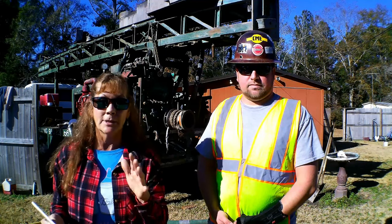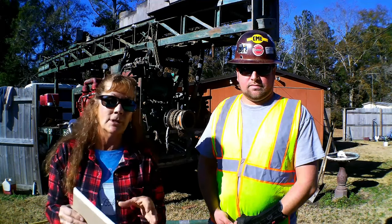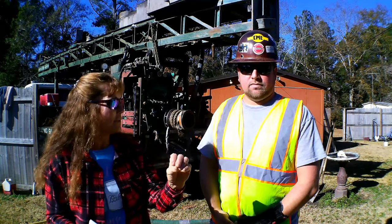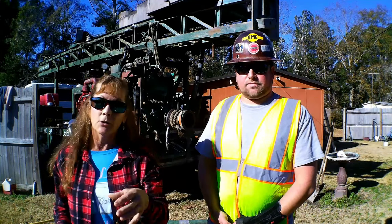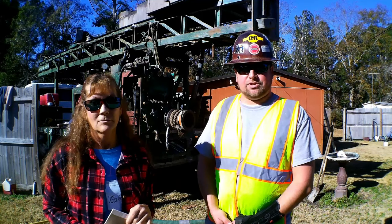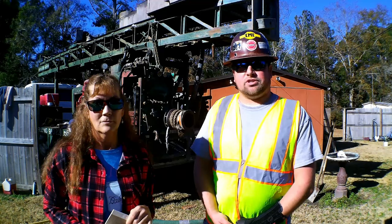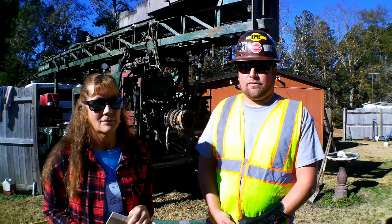I believe at the very end of this video, you'll be amazed at what it takes to drill a well. And don't forget, this is not just drilling a well and putting a tank and an electrical pump on there. Am I saying that correctly? Yes. And he's also putting on a hand pump, so off-grid, on-grid, no power, it's on. We're going to have a submersible pump, 1 horsepower, 25 gallon per minute, Franklin Electric pump. And we're also going to rig up a Simmons pitcher pump on top, where she will have the option to isolate if the power is off and hopefully pull water with the hand pump.